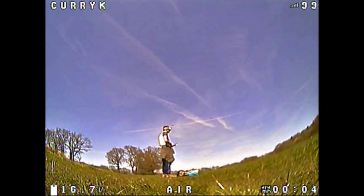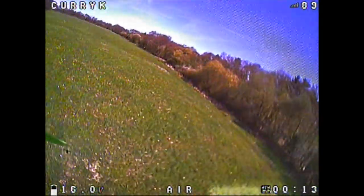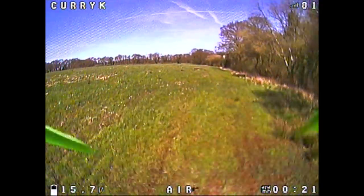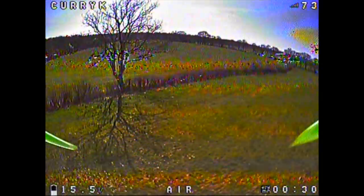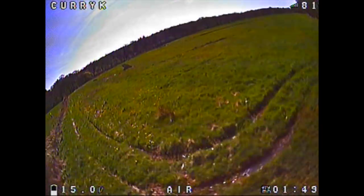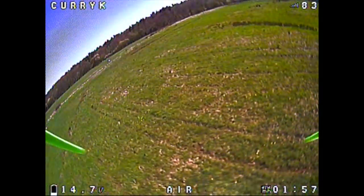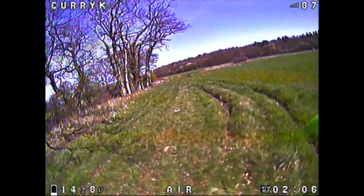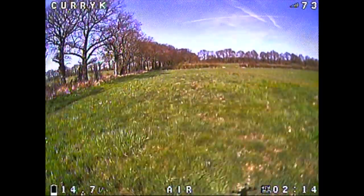I went on to the second location - this is where you can go a little bit further. Not a huge distance, but I kind of feel for mini quads this is about as far as you'd ever really want to go. Up to the end of the field it's about - I measured it on Google Earth - I thought it was 200-something, but it actually turns out to be about 323 to 350 metres at its real extents. You can get down nice and low and get behind a tree, and that's pretty good. With having a pagoda as an omni there's no problems going behind yourself, and the patch is there obviously when you're in front. I'm quite sold on using diversity now - these patches are so nice and small I can just tuck them in my goggles, no problem.